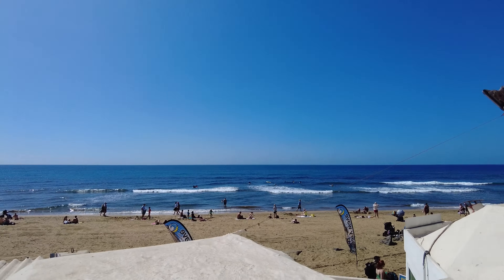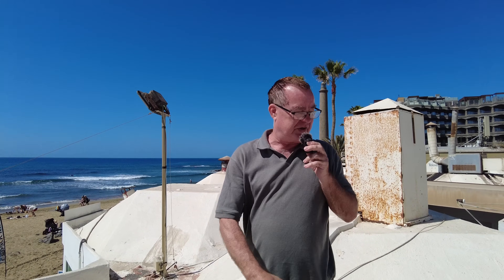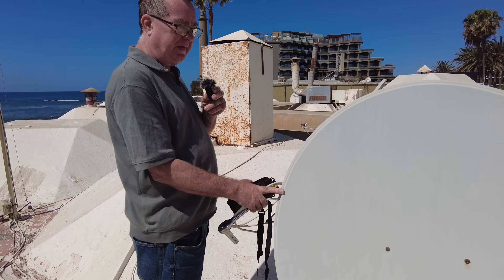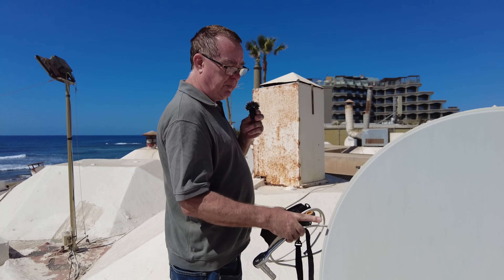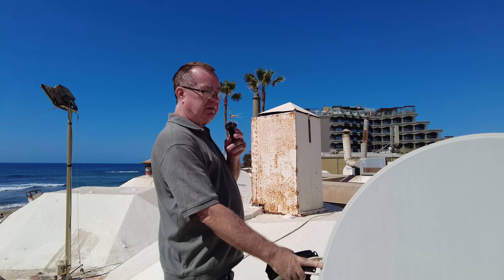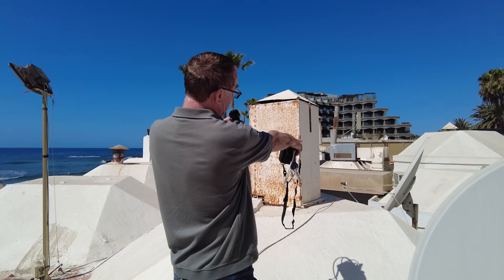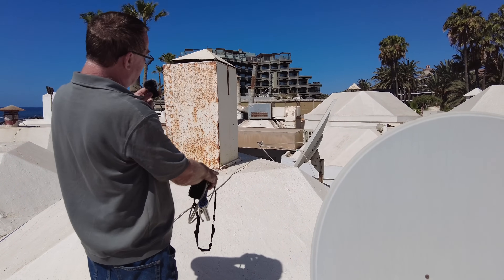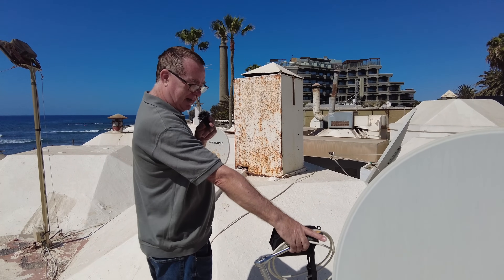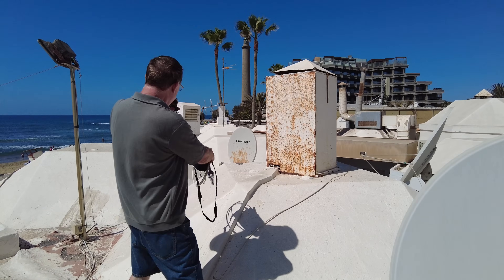We're on the roof of the bar now. The first thing you'll probably notice is a very nice view up here, but there are also three satellite dishes. This is the Sky dish — we can receive Sky Sports here but none of their free-to-air channels or the movie channels. With this one-metre dish we get Sky Sports. Normally for the other channels you'd need at least a 3.2-metre dish. There's another dish just over there pointing completely the opposite way, 90 degrees away — that's our BBC and ITV. In the UK you'd get them off the same satellite as Sky, but here we have to use a completely different satellite to receive a signal.